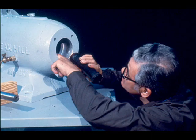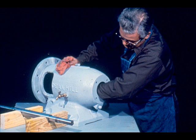As you did with the shaft, check the shoulder in the bearing housing for squareness. This is very important to the correct and efficient operation of the bearing. Once you've established that all of your fits are all right, clean the inside of the bearing housing thoroughly and dry it carefully. You are now ready for the installation of the new bearings.